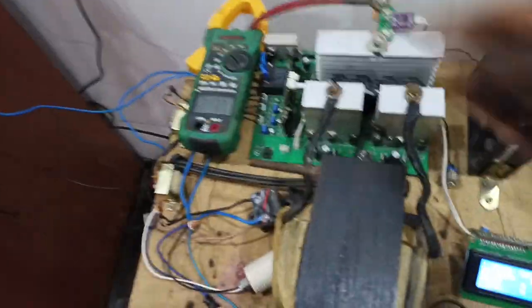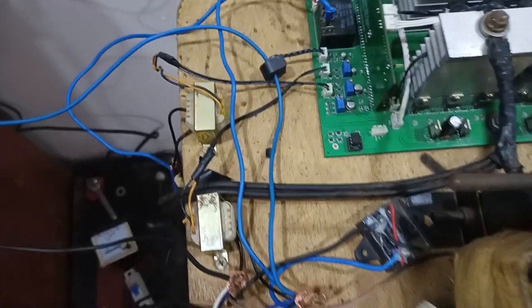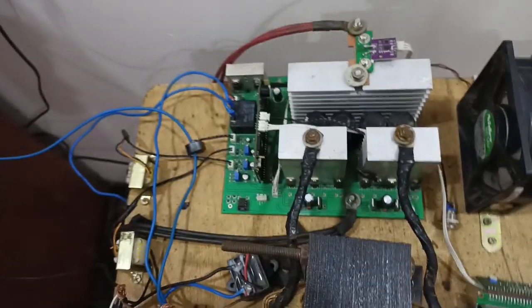This is the overload test for the inverter — so far so good. The overload protection works. But if I want to make it carry the drilling machine, I will just need to go back and reprogram the control card to handle up to 800W. I feel better with 1000 VA, because the transformer is supposed to carry up to 1000 VA and the MOSFETs are supposed to drive up to 1000 VA. But for this test, I just wanted to show how the cut-off works. They use current sensors — the current goes through the current sensor from the inverter, and that is how the overload is detected.